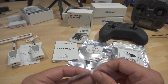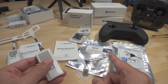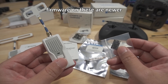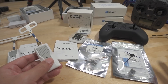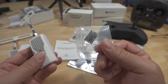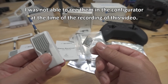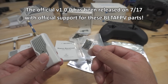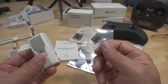However, I have not been able to get these BetaFPV modules to bind with any of the Happy Model receivers — they will bind with BetaFPV stuff. I think they've compiled the firmware with certain options so everything works within the BetaFPV ecosystem, but Happy Model receivers may have been compiled differently. I considered flashing new firmware, but these parts don't exist yet in ExpressLRS Configurator, so I'm waiting to hear back and don't want to risk bricking anything.